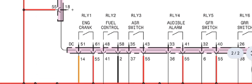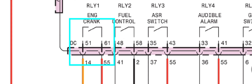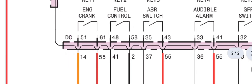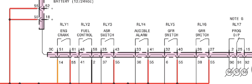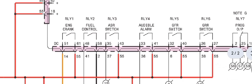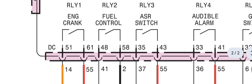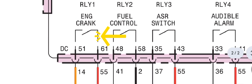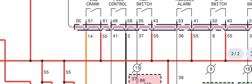Inside the 70-pin connector, we have 70 pins. You need to find pin 51 and pin 61. Pin 61 is your input supply. As you can see here, we have relay contacts — relays one through seven — these are all normally open contacts. Pin 51 and pin 61: we give the supply to pin 61 and get the output supply through pin 51.